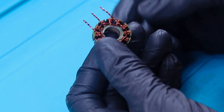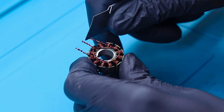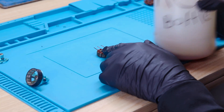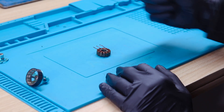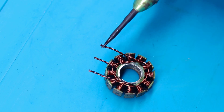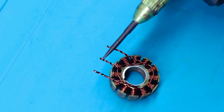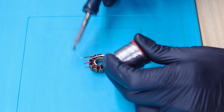Now it is time to attach new silicon wires to the copper wires, but first we need to remove the insulation on the copper wires. There are lots of methods to remove the insulation — you can scrape it off using a blade, or use insulation removers from the market. If the insulation is not removed, it will take a lot of time and heat to solder or pre-tin the copper wire directly. Here we are going to use the insulation remover bought from the market. We apply a little bit of the chemical at the end of the wires and leave it for a few seconds, after which we can pre-tin the wires and attach the silicon wire.